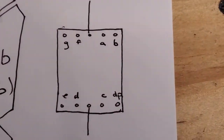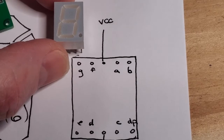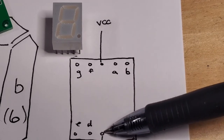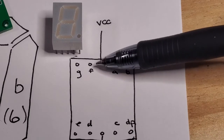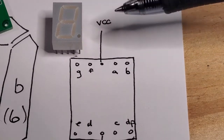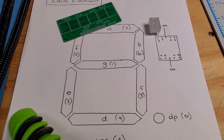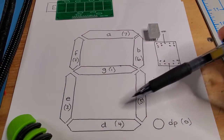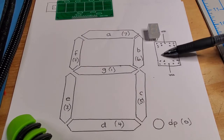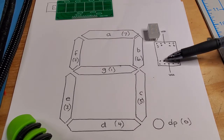Looking from the top of the digit, you can see the pinout: VCC is the top middle and bottom middle pins, and then the segments A B C D E F G correspond to these segments here. So here are the segments A B C D E F G and here's where they correspond to on the LED itself. As I said, common anode: supply VCC and then ground the pin. Common cathode is the opposite — ground is common and you supply voltage to whichever pin you want to turn on.